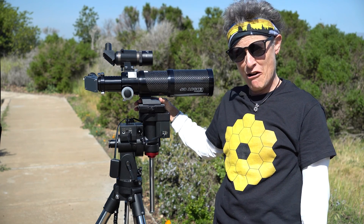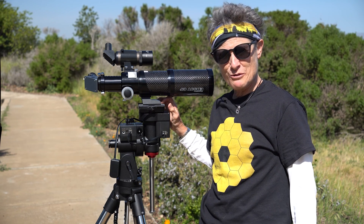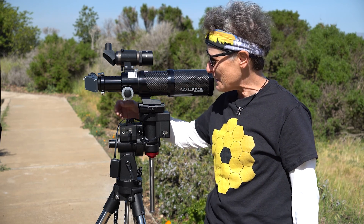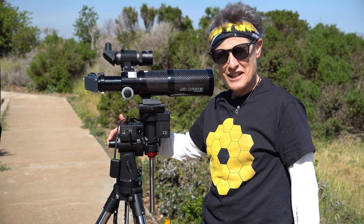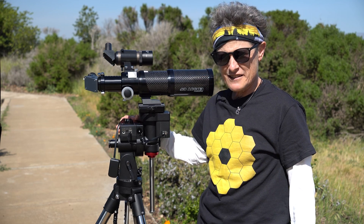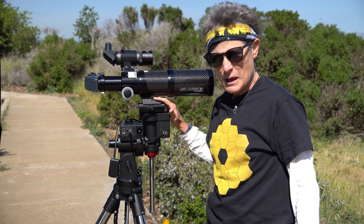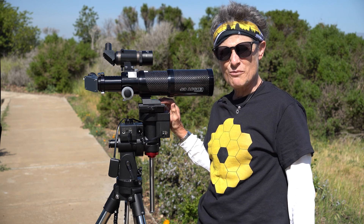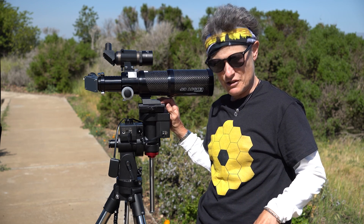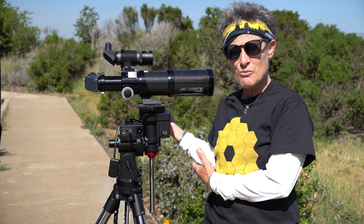Persistence paid off. I was just about to give up and go to the hardware store, but that last fold of this little piece of aluminum foil seemed to do the trick. The last time I looked through the eyepiece, it was dead center with the object and the polar scope. Tonight I just have to see if it's clear enough to test it out. I'll probably replace the piece of foil with a shim which has a precise distance and isn't subject to compaction. But there you have it folks — that's how you line up your telescope with your telescope mount.